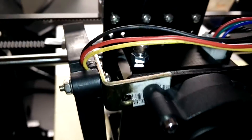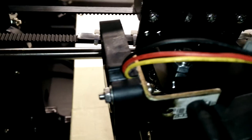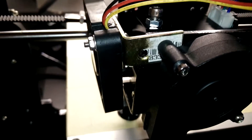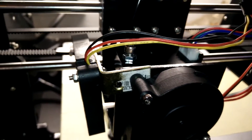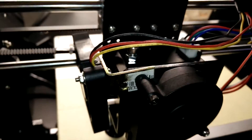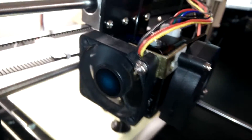Something I changed with the printer from last time: I removed the small heat sink from the extruder motor part, because the filament clogged the extruder and I wanted to have a bit more control so I can look in and see what's happening inside. I just found this 90-degree metal angle and mounted a 50 millimeter fan on the shuttle for now.